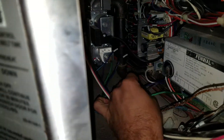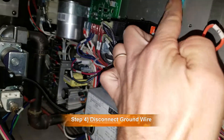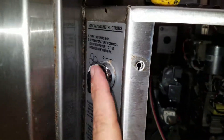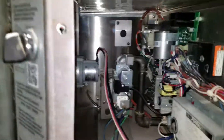All right, I had to cut the zip ties off, disconnect that one wire, and now I've got to take off the ground wire here. Just a side note: if you have an XLT oven without an XLT hood, you've got to use this switch here. This one's been disconnected because the XLT hood works in conjunction with it. So I got that off.